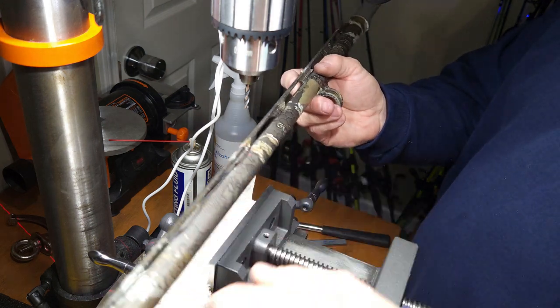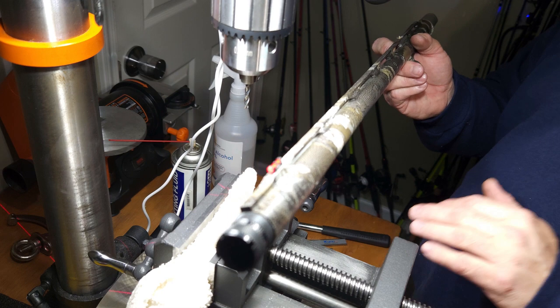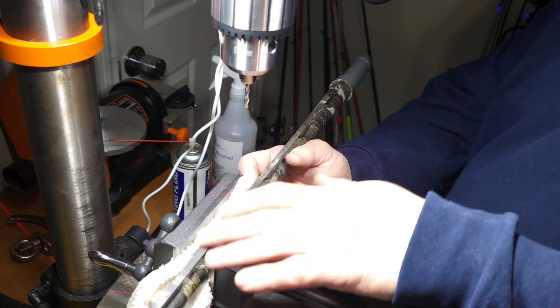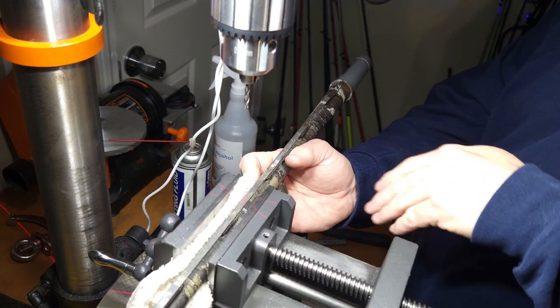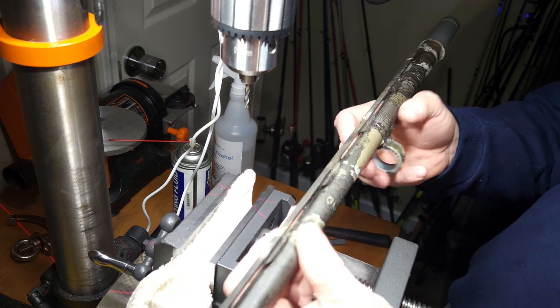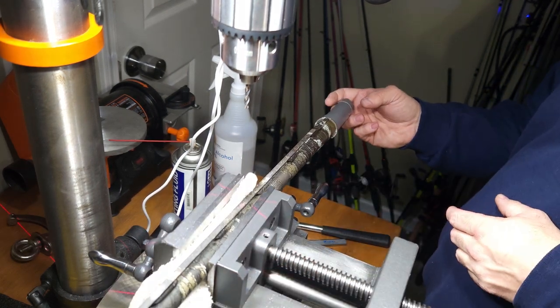I wrapped this barrel with this cloth and put it in this vise. I had to take this table and make sure it was level. I put a level on the vise right here to make sure it was level. Then I put special sight mounting levels on the rib to make sure the gun wasn't canted to one side or the other, on everything perpendicular. And then I put a laser on the rib to make sure it's level this way and isn't canted one way or the other. So most of my time was actually in setup. The drilling and tapping doesn't take long at all.